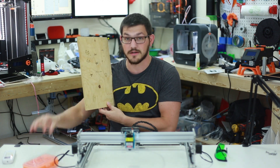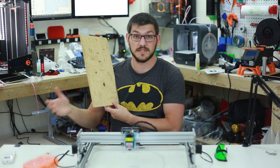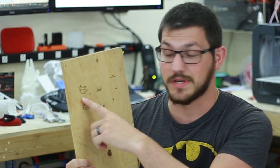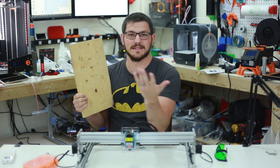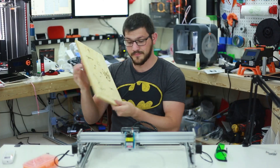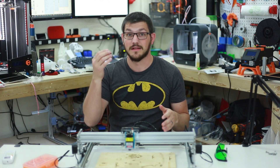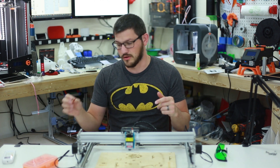The original stepper motor I have right here was actually bad, which caused a lot of my issues. So I replaced the stepper and things got better. Before that I had a short fat Pikachu, then a not-so-fat Pikachu, but I double-scaled it and it looked exactly the same. The fox I was trying was supposed to be 20 millimeters wide — he's 65 millimeters wide. Luckily I had a spare stepper from 3D printing, so I was able to easily fix that and tune it.